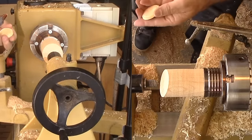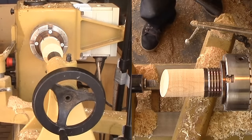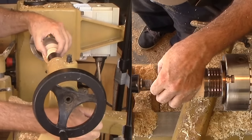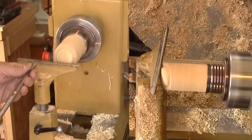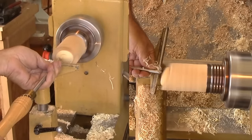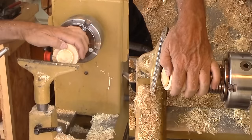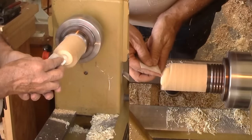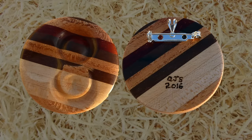Now over to the large lathe with the tilt chucks. In Janice's session, we decided that we were shifting to a skewed axis, so they probably should be called skew axis chucks. Again, no double-stick tape in sight so I used hot melt glue. After guessing where the chuck needed to be on the surface of the skew axis chuck, I glued it on. Don't use hot melt glue unless you have to — double-stick tape is the better route. Then I turned the button on the face of the disc; this is much like a natural edge bowl but in miniature. A lot of cutting air to get started — this always has a high potential for a catch. Then some careful sanding before applying shellac. After wood burning my signature, I finished the back side and buffed each disc. Finally, I glued a combo finding onto the back so the disc could be both a pinned brooch or a necklace pendant.